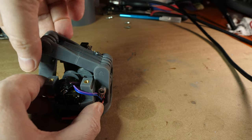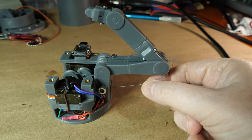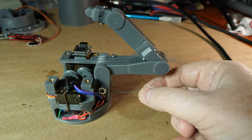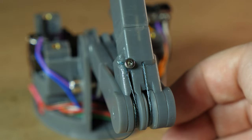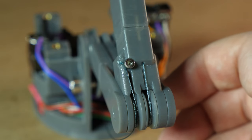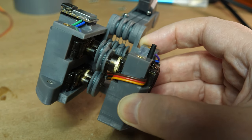So I made a mistake. Somehow, in my rush to get it assembled, I forgot to loop a line around one of the spindles, and there's no way to fix it. I forgot to loop the line around one of the base spindles, and when the bottom joint turns, this other line loses all its tension. And because I was overconfident, I cut and glued in those lines, so the line has to be replaced. But because I glued in the servos, there's no way to get to where I can replace the line. So this one is toast.